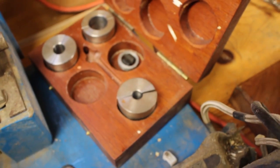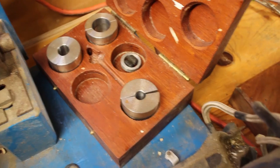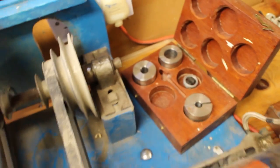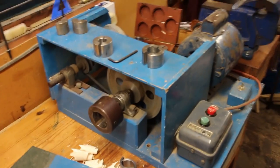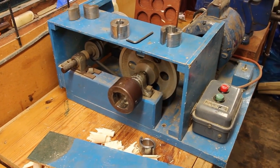You could actually use a standard woodworking lathe if you have one that goes down to quite a low speed, and put in a scroll metalworker's type chuck. If you've got something like a Jet woodworkers lathe — one of the nice ones that goes down quite low in speed — you could just put a scroll chuck on that and get the same effect. I built this machine a while back and I quite like using it, but that's what I use anyway.